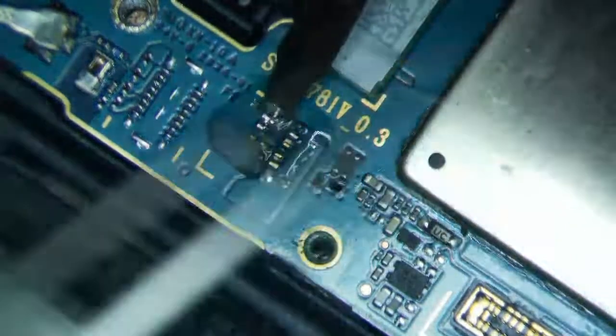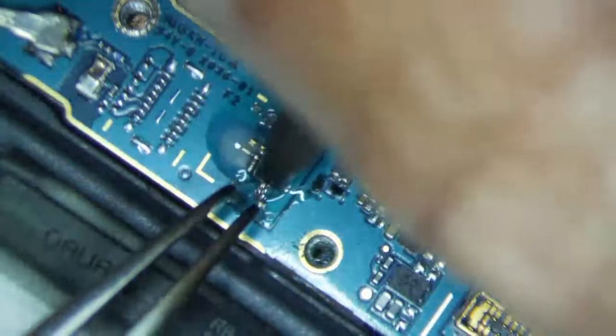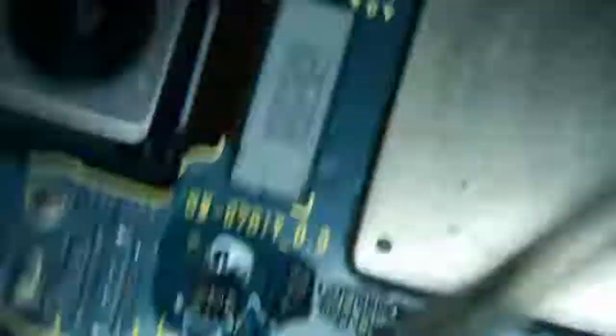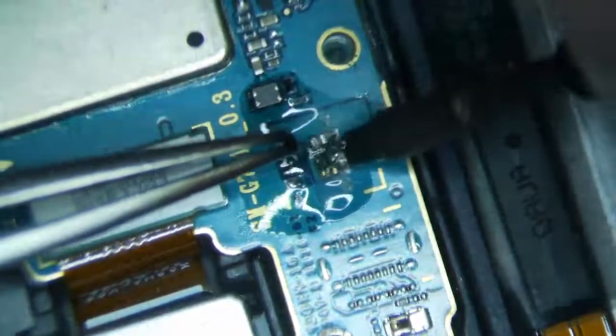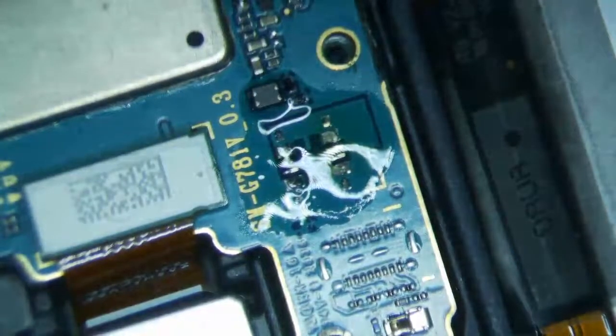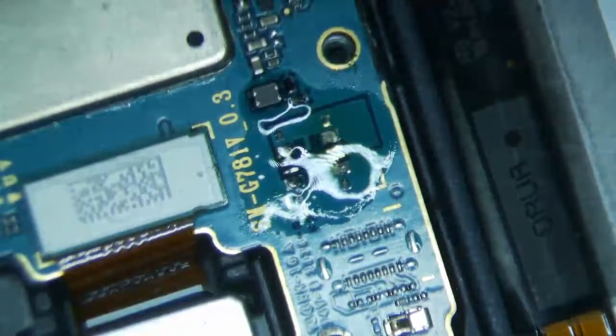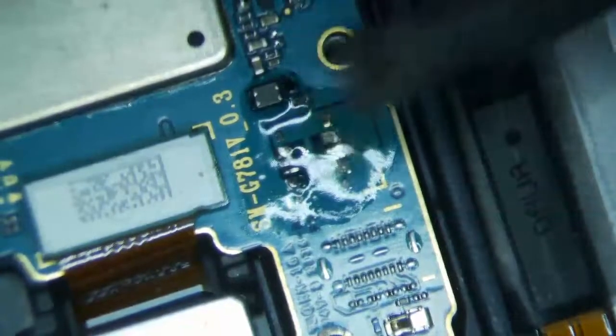By the time you get it shipped over here, the price is just going to be a little bit less, so I'll just use the Amtech stuff. What I'm doing here is using my JBC C105-113 tip to remove the broken pins on the connector. I was using the knife tip before — the C105-112 — but they kept going bad on me and they're like $30-something a tip. These C105-113s are so much better, and this one has lasted me at least six months. Stick with the C105-113. This is for the JBC NASE 2B nano-soldering station. There's a newer version out right now — maybe the 2C — that uses different tips. This is a slightly older version that uses the C105 tips.